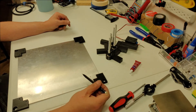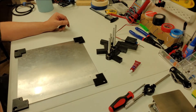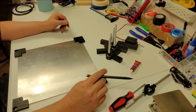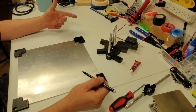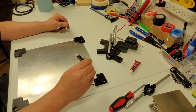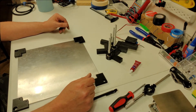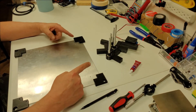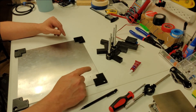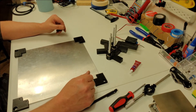I ordered this from Amazon. It's 1/8-inch aluminum, about 10 bucks. It's fairly square — they don't guarantee it's exactly one foot by one foot, but it's close and we'll work with it. Just put your top pieces on there, mark through the holes, pilot them, and then drill from the other side so you can countersink them. I've already done it. We're going to mount these right now so we can get the measurements we need for the aluminum angle. We need to put these together first and then pop these on — I'll show you how to get the measurements you need for the angles. I'll be right back when I get that all set up.